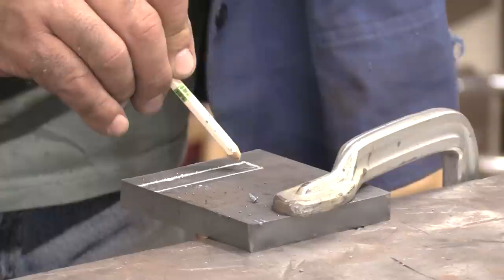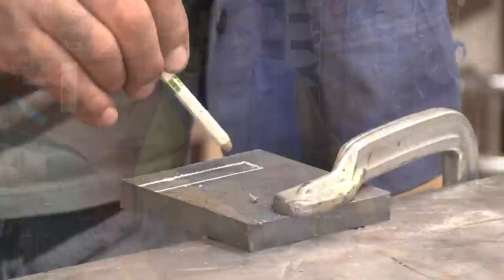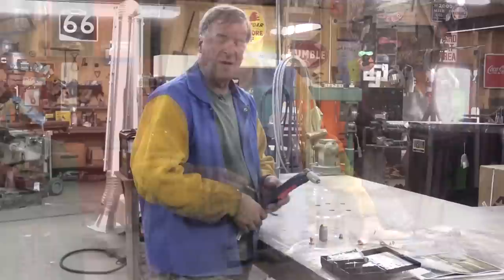So what I'm going to do here is come into this channel that I marked out, and I'm going to gouge out half of this metal downwards through the thickness. It's five-eighths thick. I'll gouge out this halfway, and then I want to come in and just poke a hole through here, like if I was going to lay a wire or a cable in there, able to run down through there.